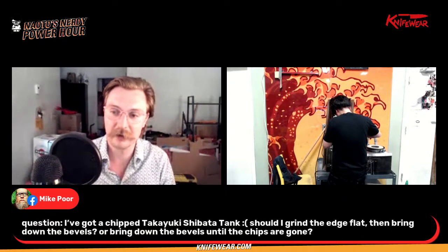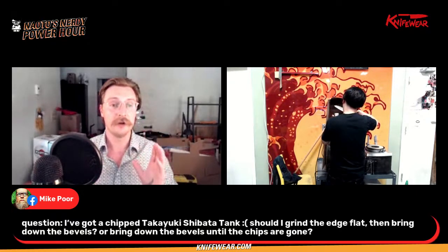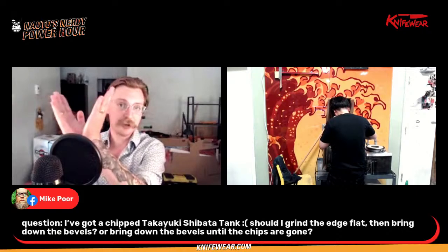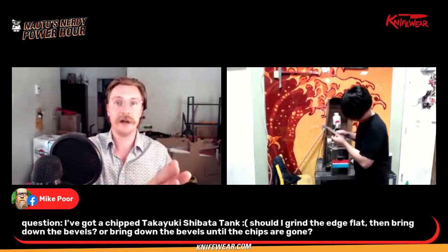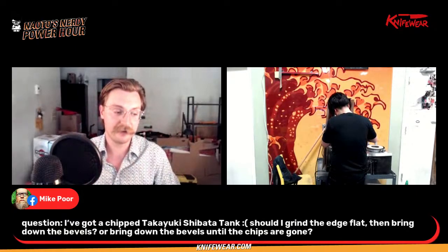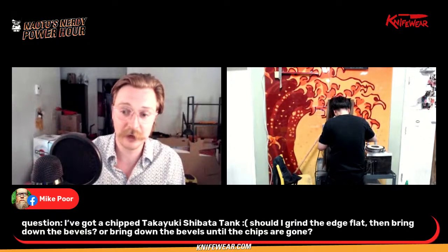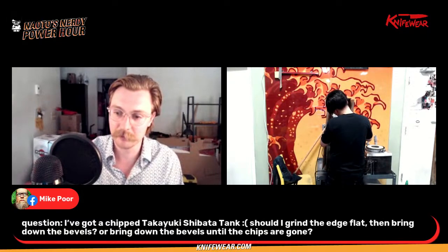I mean, maybe you've got lots of skills, but often what we'll do at Knifewear stores when we have a customer whose knife we're repairing a chip on, rather than just sharpening the bevel to remove the chip, we'll bring it up at a really aggressive angle, like 30-40 degrees, Mike, and we'll grind the chip away and maintain the profile. It grinds faster, and then you drop the knife back down and thin out the bevels. So you're not doing it at 90 degrees and flattening out the edge, but you are doing it at a more aggressive angle. It works more quickly, and that seems to work really well. If you're doing it by hand without a machine, you're going to have some time to spend on it, but it'll be worth the effort.